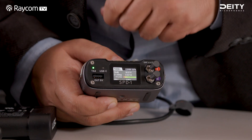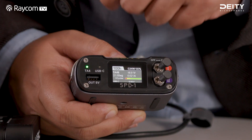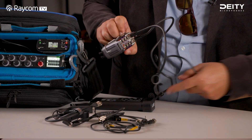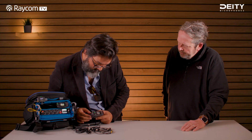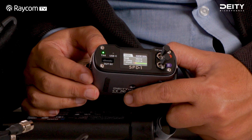On the front display, it starts with how many hours are left on the battery, which makes it easier than converting wattage into time — what you need to know is how long you've got. You can see in the top section the telemetry of the B input, since the inputs are labeled A and B. At the moment we're drawing 0.2 amps because the screen is on. It shows the battery is at 21 degrees and has eight cycles on it.